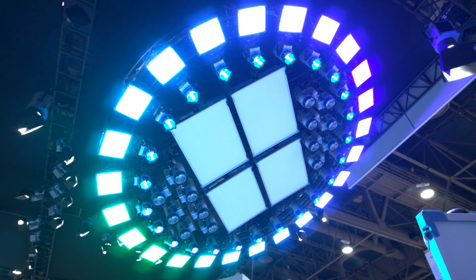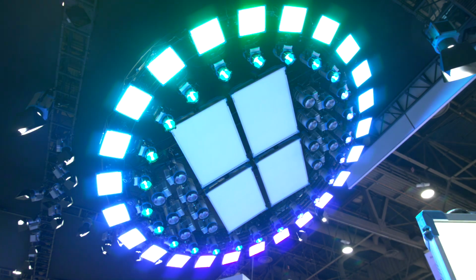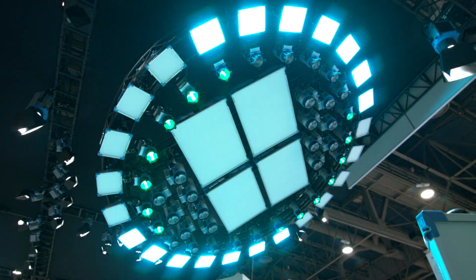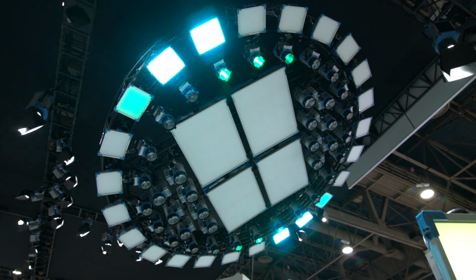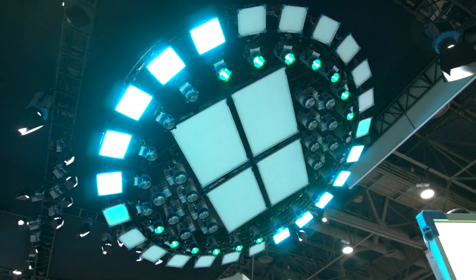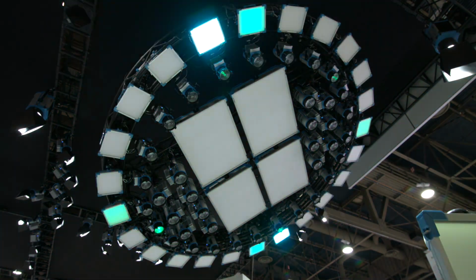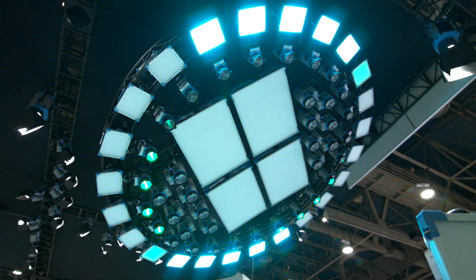We have a bunch of other features as well. We have a stage mode, which is great for dimming for live audiences. It's not for motion picture capture, but for live audiences, it gives a very beautiful dimming down to 0 without any sudden drop-off in intensity. We also have an ultimate DMX mode. Ultimate DMX mode allows you to select whatever color mode that you want in one DMX mode. So you no longer have to switch between DMX modes when you want to go from a color temperature to a lighting effect. That's really handy as well.